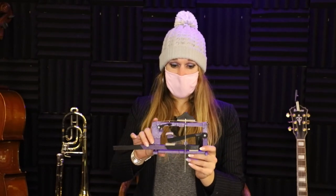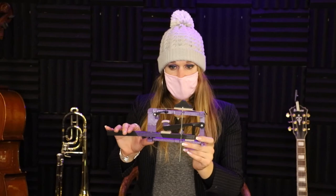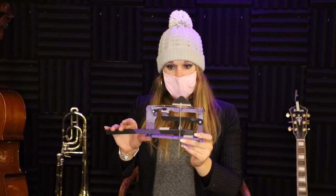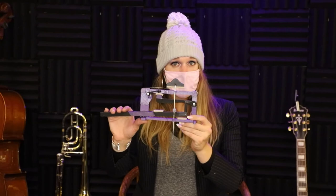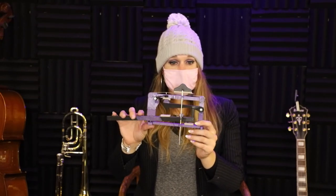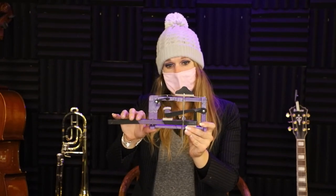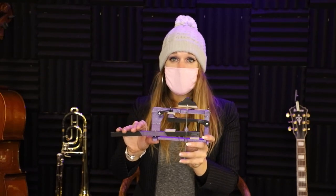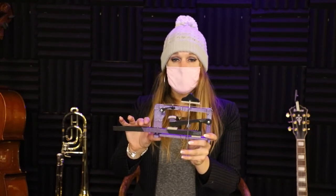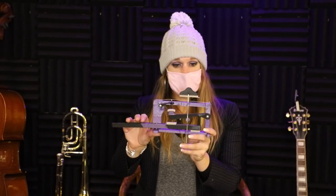Continuing on with our goals of this design concept, everything works exactly as intended. The normal mechanism of a clavichord works. You can get audible pitch bending by forcing the key down. And the damper mechanism works just like it does in a piano — the damper is raised when the key is pressed, or if a pedal system raises the dampers, the key can be released and the note will still sound.